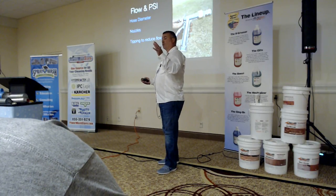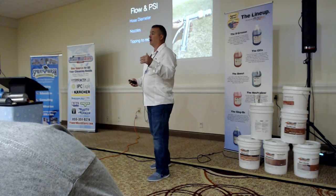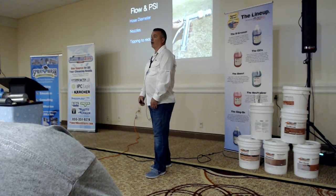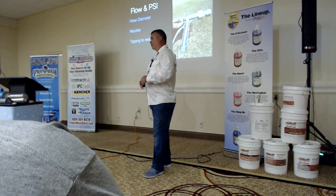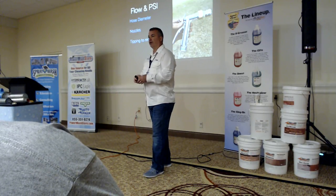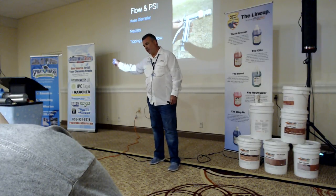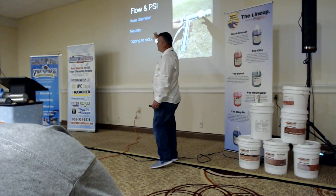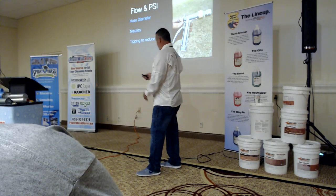Now, when I'm spraying my hot solutions, I can keep up with that. It's hard to keep up with 5.5 gallons a minute of 3, 4, 5% sodium hypochlorite. It's going to run off whatever you're spraying it on. You're going to have too much. You don't need it. The other good thing as well, especially for roofs, is that it gives you that PSI, so you're not just trickling out. You can actually paint good swipes with it, and you can customize it, because you can adjust the flow on it. It's not a set thing. There's a range. It's just an optimum it likes to run at.